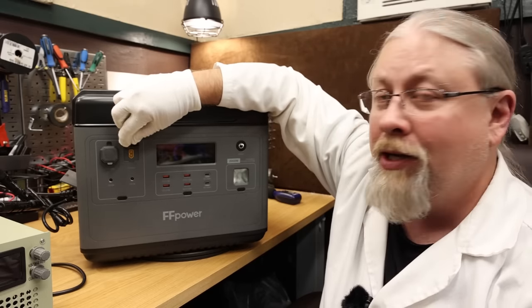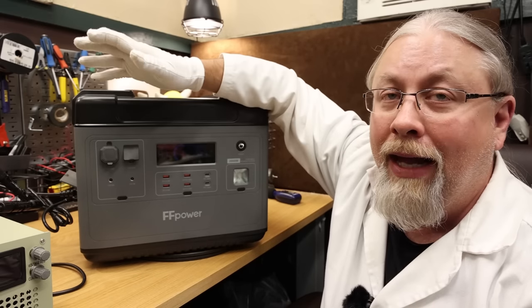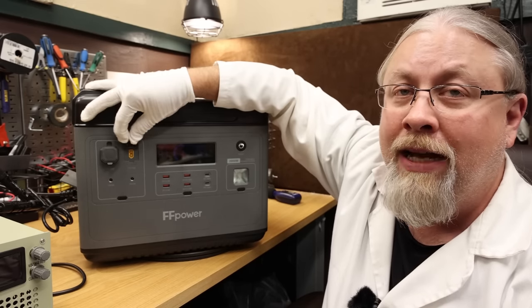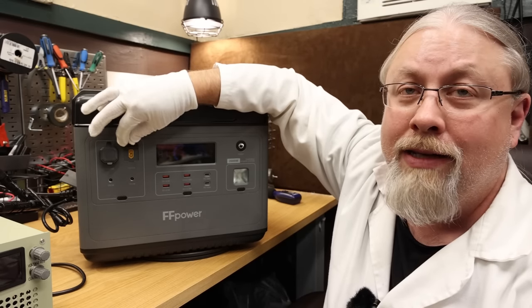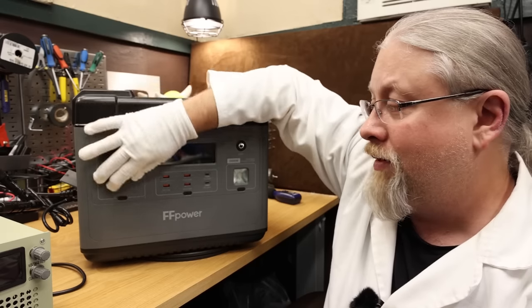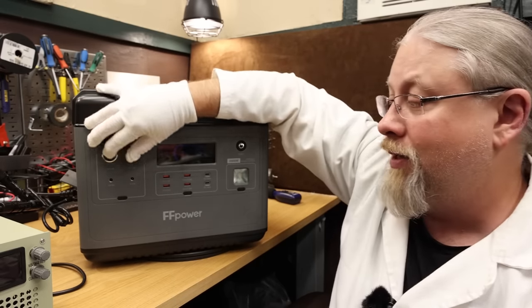Now, just be aware 10 amps isn't very much power. It's only 120 watts at 12 volts. But you could essentially power a Fantastic Fan or a MaxxAir fan with this XT60 connector. You can also plug in a second refrigerator. I can think of a lot of uses for an XT60 12 volt output.